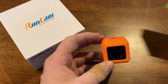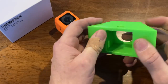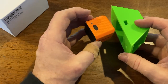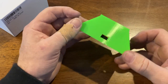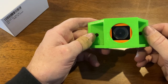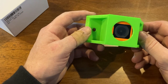So I had to design something to mount this on the combat robot, and I ended up 3D printing a little mount box. This one's kind of cool because it's made out of TPU, so this is flexible material. It's designed to hard bolt down to the frame, and also designed in such a way that when it's mounted in place, you still have access to the button to turn it on. You get full field of view here, so you don't get any of the green in the way.